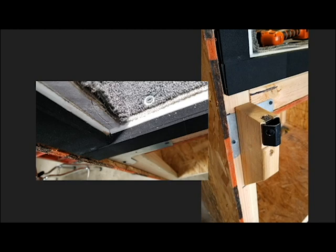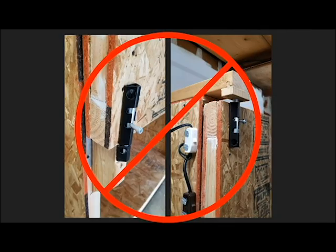You can see in this shot the foam layer — the biggest layer is the quarter inch, and to eat up the remaining gaps I used the eighth inch, so the total foam gap is almost an inch thick and it compresses down about a third of the way. Originally I installed a door rest for the door to sit on, and my plan was to use heavy duty gate clamps on the top and bottom to hold it shut. That worked to hold the door shut but didn't work to really push down the foam to get a tight seal.